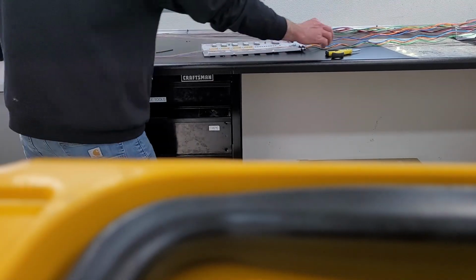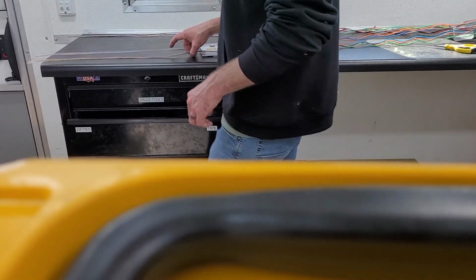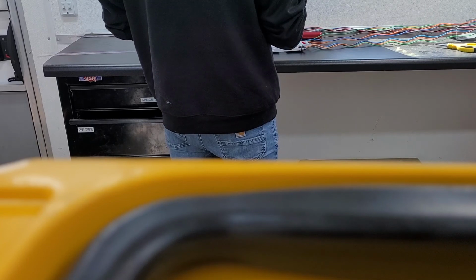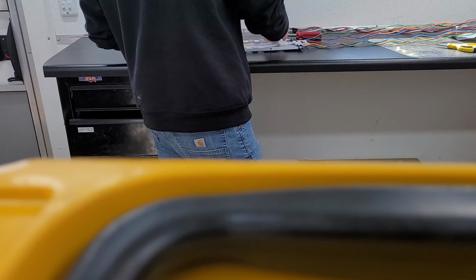All right, now I'll make sure both sides of this are the same length. Okay, another even Steven. So now I'm gonna take these and bundle them up in here. One of the tricks, I'll tell you, about a short fiber like that, instead of trying to splice to the other cable, other buffer tube, other fiber that correlates with that color and tube, directly off that little shorty, the little piece that broke off, you can actually splice that back on and make it longer.